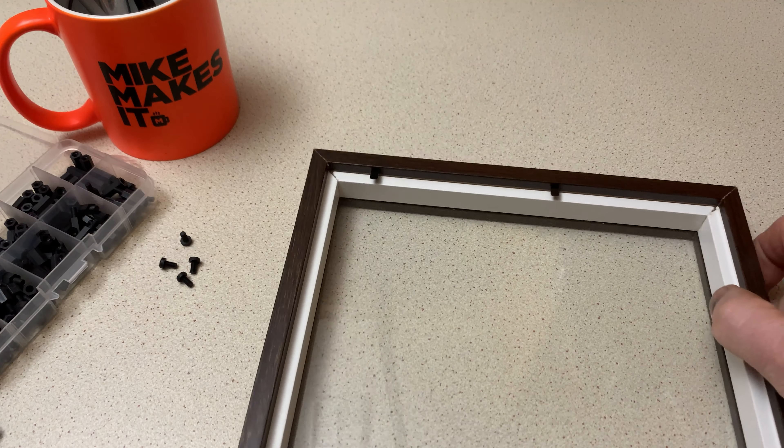In the little tub I have some of these plastic pillars that will subsequently attach to the Raspberry Pi. I need to open these holes up a little bit and countersink them on that side. Before we do that I want to cut a slot for the ribbon cable, so I'm going to change the drill bit to one of these — I've not used it before; it's not quite an end mill but I should be able to drag it sideways and cut a bit of a channel. Not sure how neat it's going to be — you're not going to see it, it's on the back — but obviously the better you can get it the better. I could possibly come back with a Stanley knife; I've used that before on another display I made.